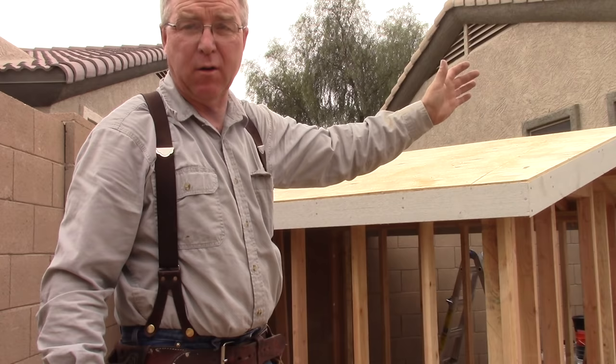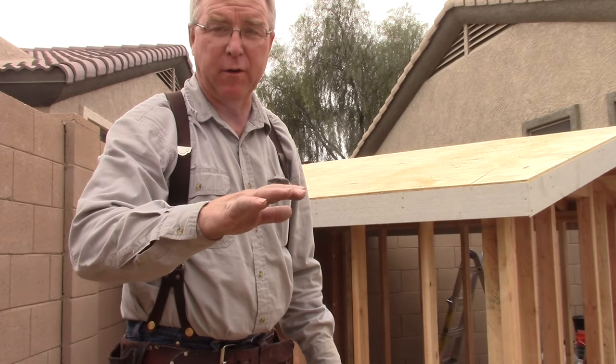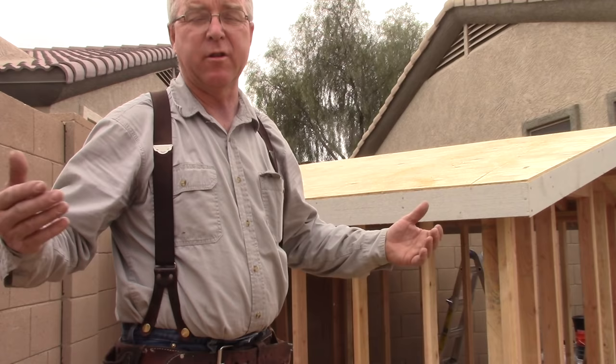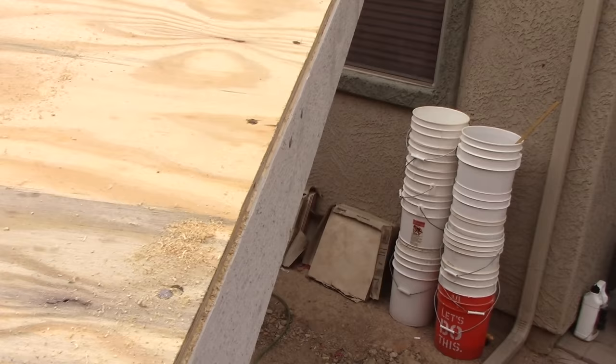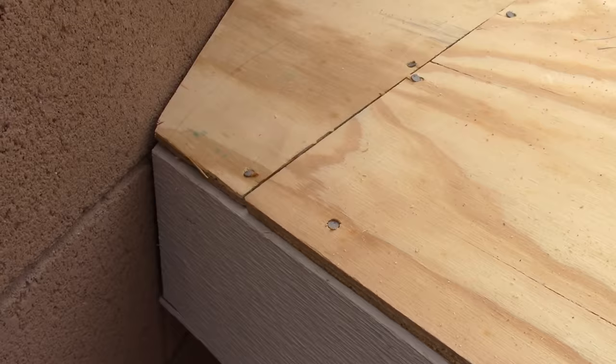Those pieces of roof sheathing that went out over that prow-shaped gable-end overhang were all cut without pulling out my tape measure even one time. You can lay roof sheeting over a piece that is located on the center of a joist below, or running wild on the rafter below. Overlap them, snap a line, cut them both at once — both excess pieces will fall free. You don't need to measure. Put it on the sheet, snap. You can do it in place a lot faster, and you get a nicer fit this way than if you cut it on a set of horses and then sent it up.